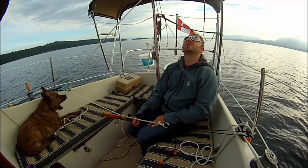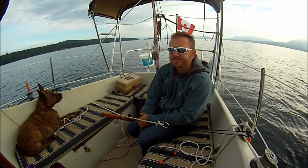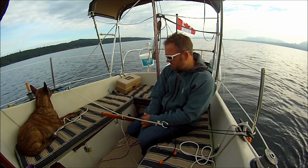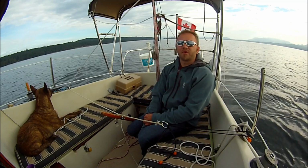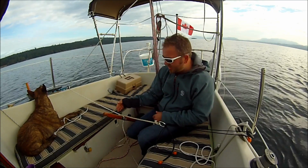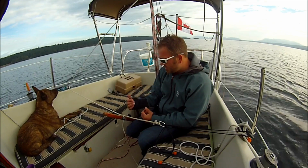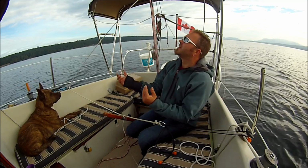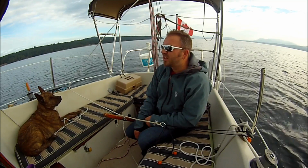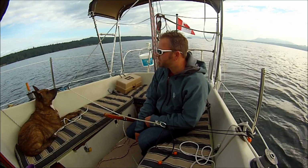We're rounding out of the wind. The sail dynamics are starting to power up. It's as easy as that. Wait for it to take over, and if it doesn't, give it a little more. And when you adjust these things, only adjust it maybe half an inch to an inch. Once you get this thing balanced, it'll steer for hours. Didn't cost me anything. You've probably got some spare rope in your boat. You've got a couple of spare blocks. Everybody's got bungees. Even the cheap ones they use for bunching up your sail on your boom. Any of those.